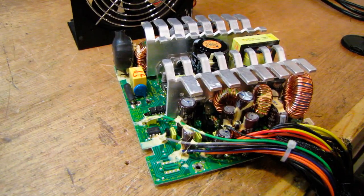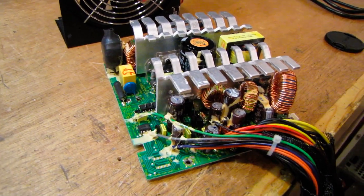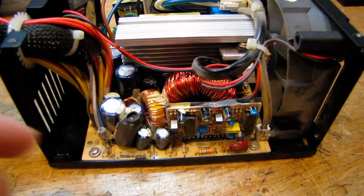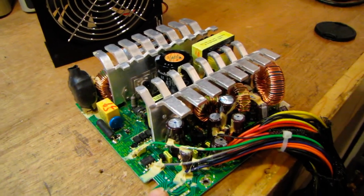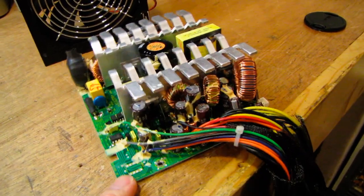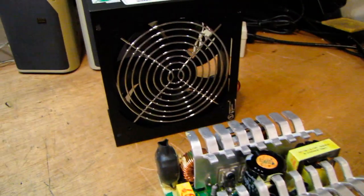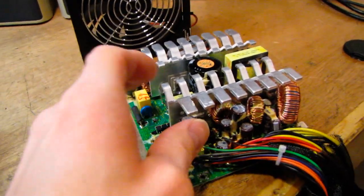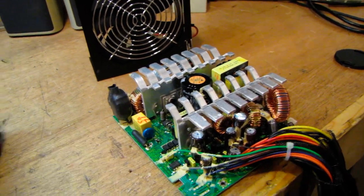Another thing people ask me is whether there are any power supplies I would recommend. That's a tough question because I've worked with a lot of power supplies, cheap or expensive, and I always seem to find quirks one way or another. Either you have one like this with a good circuit design and good cooling but cheap capacitors — that's the most common instance with mid-priced units — or you have one like this expensive power supply, over a hundred and twenty dollars, with good quality components, nice capacitors, and nice circuit design, but they don't cool it properly. That's actually a fairly common problem — fan control circuits to make them quieter — but where this one came up short is that it actually burned itself up after a very short period of time.